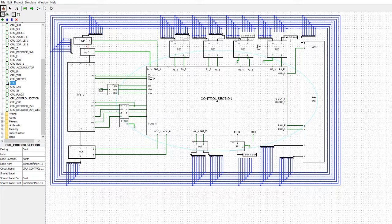So it's going to add a number from this register. Now what I've done is I've nobbled it, so I've disconnected the bus here, and I'm going to put a value in here. Okay, and I've disconnected the bus here, and I'm going to put a value in here, and we're going to add the two values together, and the final answer will rest in here.